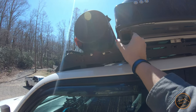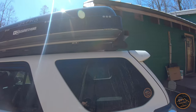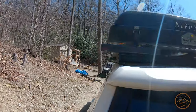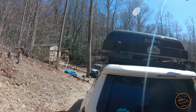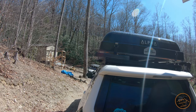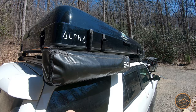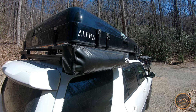I'm going to get more of these sleeves and weld them to the outside on both ends. I want the rack to be a little bit wider than the tent so that the bar comes right along in here. Hopefully that will provide a little bit of protection for the tent for off-roading and going past tight trees or brush. And in the event that we might lay it over, with the bar sticking out a little further than the tent it'll help protect it. This will also get mounted on there somewhere. So that's what I've got in mind - now we'll start cutting and you'll see how I plan to make all that happen.